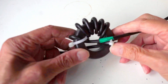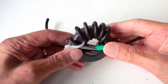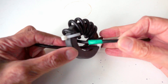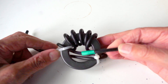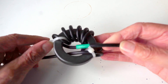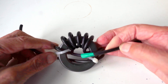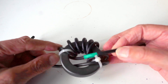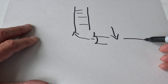For the line isolator, I use a ferrite core - normally a 240/43 mix ferrite core - with about seven or eight turns of coax around the core. I've never found the number of turns to be very critical, but that seems fine for the HF bands from 40 meters through to 10 meters. Very simple but very effective.